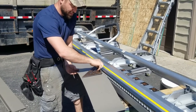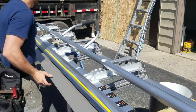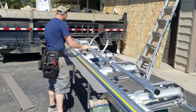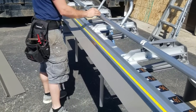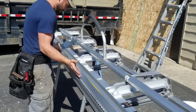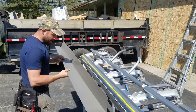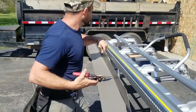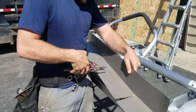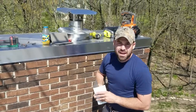I squared them all down, and I'll show you why. This is my brand new brake — I'm so happy about it. We still need to adjust it a little; there's tightness in the middle and not so much on the ends. I always underbend my step flashing just a hair because it makes it easier to install. Now we've got these square lines and we can just take our snips and go right up them — cut each side, flip it around, do the same thing — and this gives us all of our baby tins.